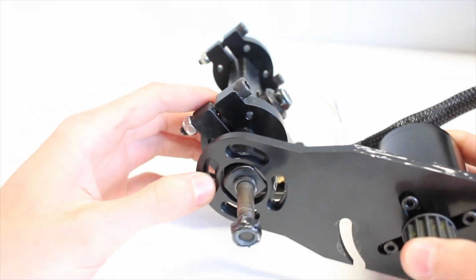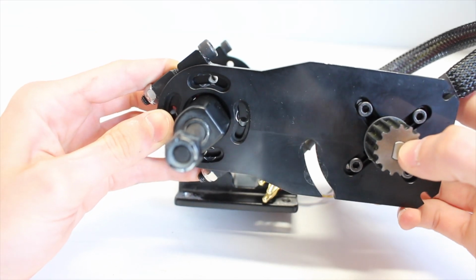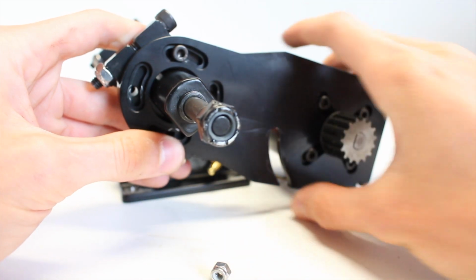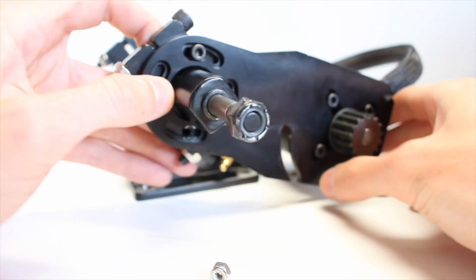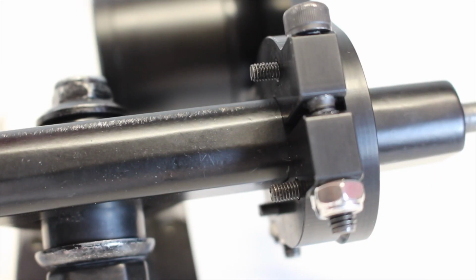Once the clamps are securely on, you can finally place the motor mount onto the clamping portion. This is an adjustable plate so that you can adjust the angle, and you'll attach it using these M4 bolts. Simply slide the 4 bolts through both the plate and the clamp portion, and then you can adjust the angle slightly to what you want, but it won't matter too much because you'll adjust it later.